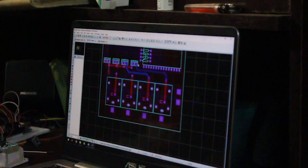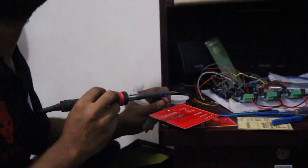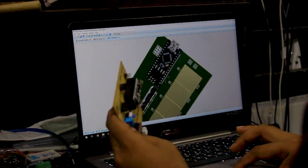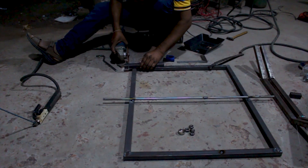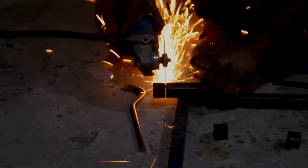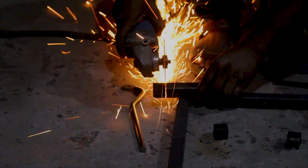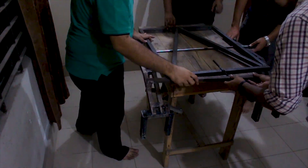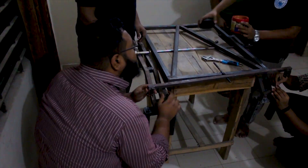BTS 7960B are used to control the actuators and the motors. We are using two microcontrollers — one to control the arm and the other to control the wheels. While working with the rover body, we had to consider many aspects including body weight, height, and strength. We used metal bars to build the rover body and fabricated the individual parts in our workshop.